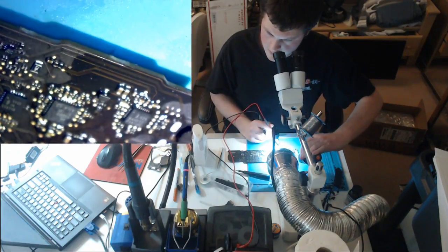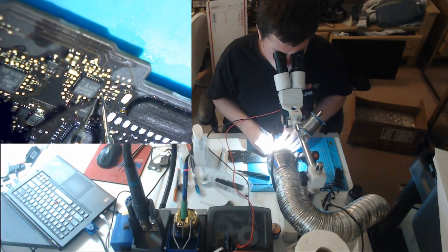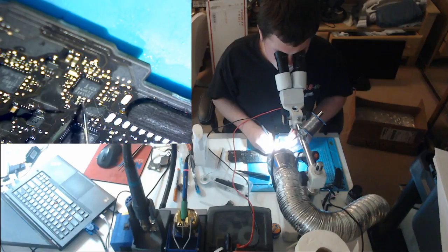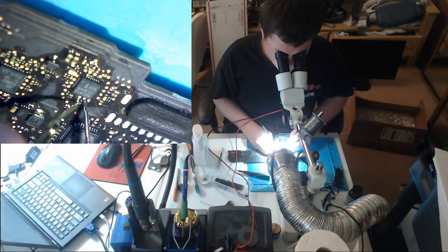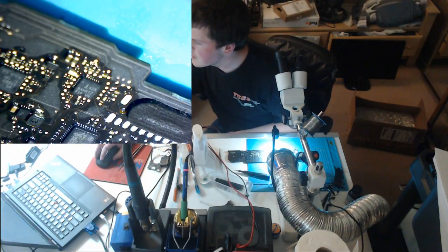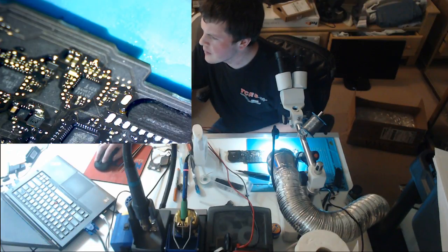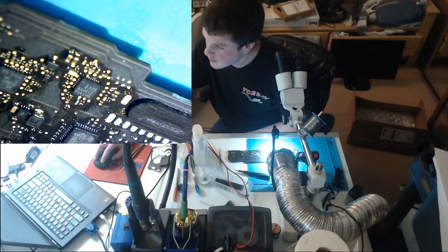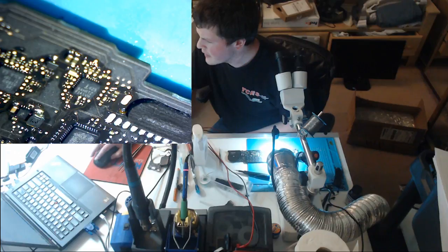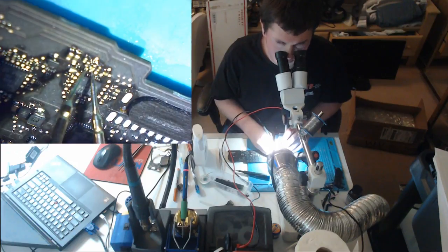So the current sense could be telling the charger, no way, shut off. Let's check our current sense. And I think that this is the right pins. And it's 3.7 ohms. And this is our second set. We get the right measurements, I mean the right pin number. Board, rotate board. So 17 and 18 is good. Now 27 and 28. I'm gonna be up here. Those are perfectly fine.